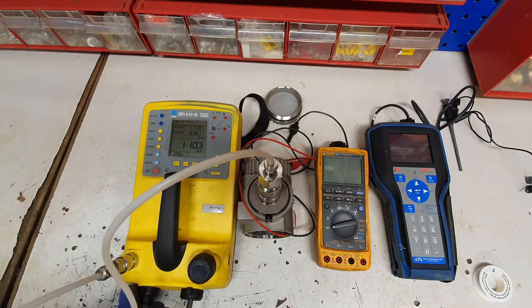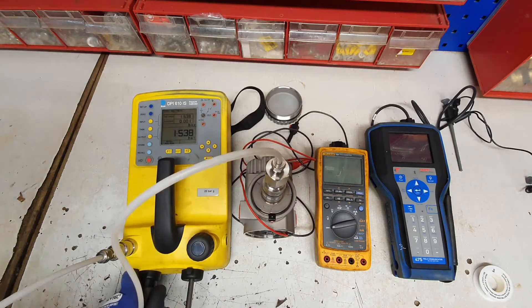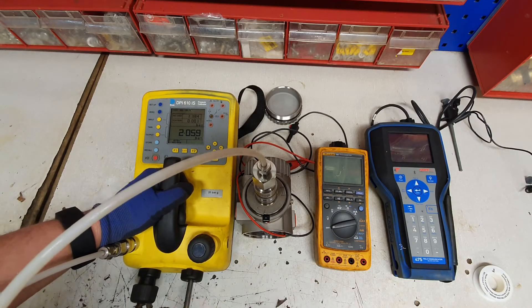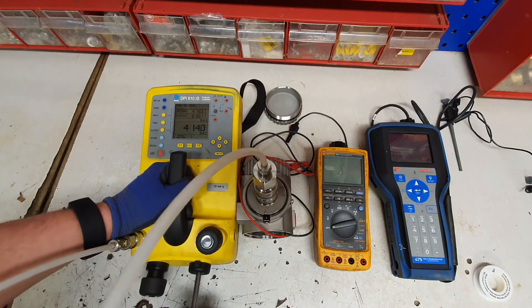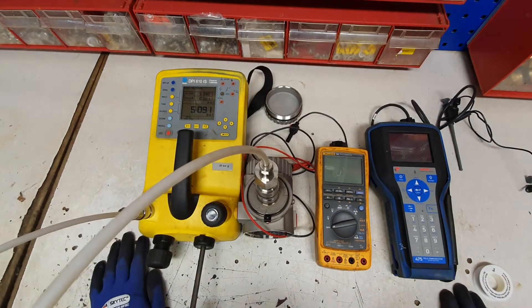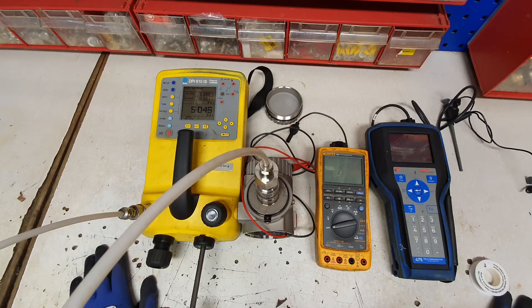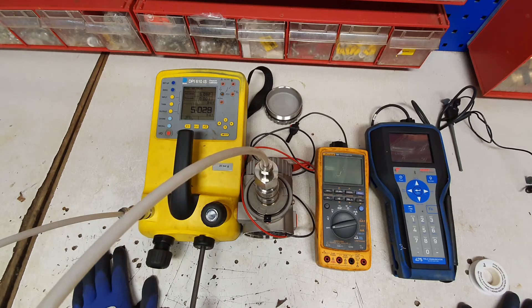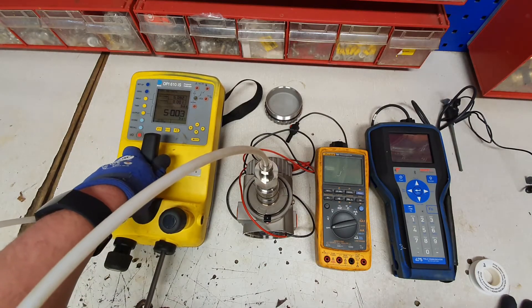This looks okay — it looks quite stable already at 1.2 bar. Just going to carry on pumping up; it will take quite a while with air. For higher pressures you would want a hydraulic pump. There we go, 5 bar — we'll now leave that for a minute or so just to make sure we're holding pressure. As you can see the pressure is falling down fairly slowly and we've got a seal which is going to be good enough for us to carry out our calibration. I'm now happy with the pressure application on this meter.